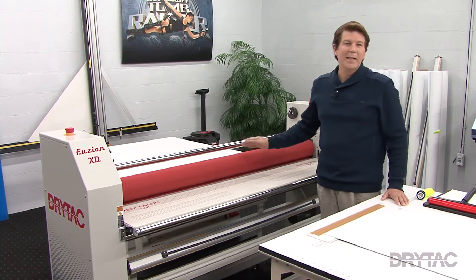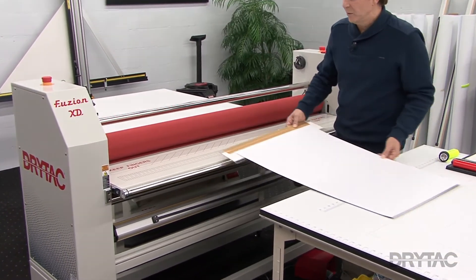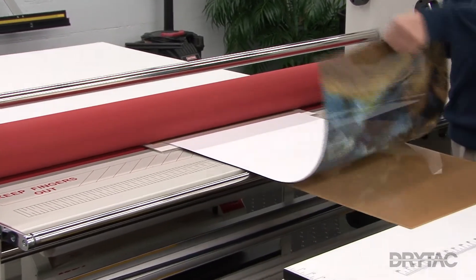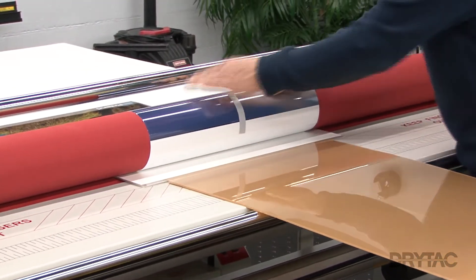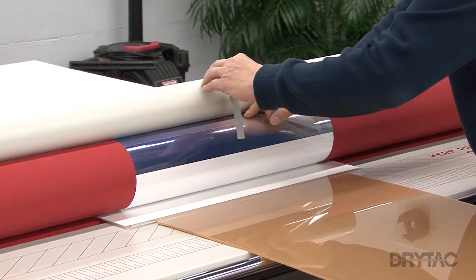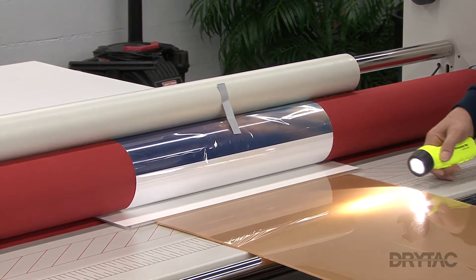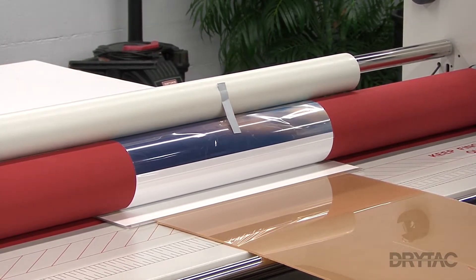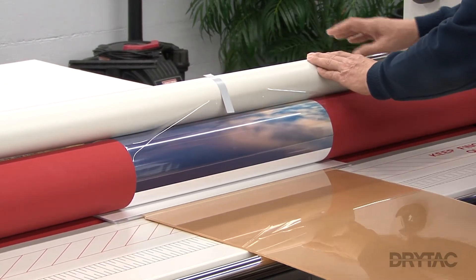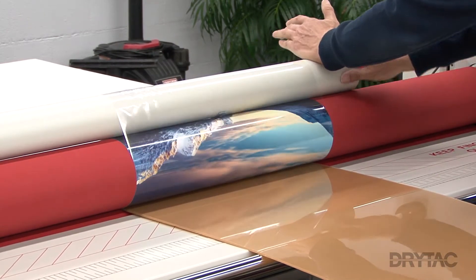All of my settings are exactly the same on the JM63 as when we pass our sled through the laminator. When you move your sheet of acrylic over to the laminator, make sure to support your leaderboard. I'll place it firmly in between the rollers and use the foot switch to jog the hinge up underneath the roller. Now we can get a nice tight wrap with our digital print by passing it over the top main roller. I'm going to use my tube to tape the release liner to it so I can use it to wind it up. This is the last chance to make sure that your board's clean, so I typically like to give it one last look with my flashlight and possibly run over it one more time with my DRS roller. Now we can start processing our print through the laminator — I'll press the foot switch and press down on the plastic tube to take up the release liner. I'll put this machine in auto run mode so we can do this process a little bit faster.